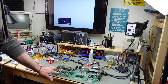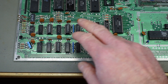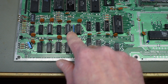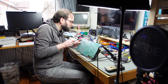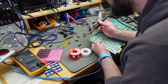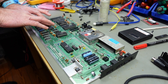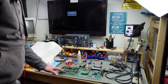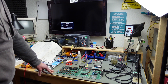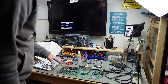The next step is to replace all the remaining RAM chips — otherwise I'm pretty much stumped. I socketed all the RAM chips and put in new ones I know to be good. And imagine my surprise — we get the exact same behavior. My surprise is close to zero at this point.